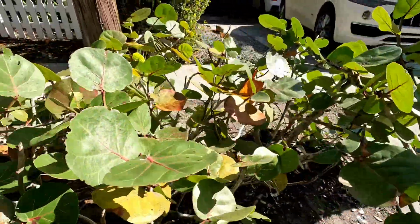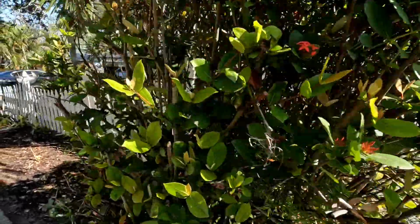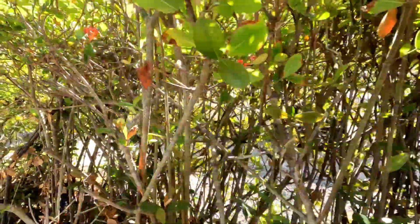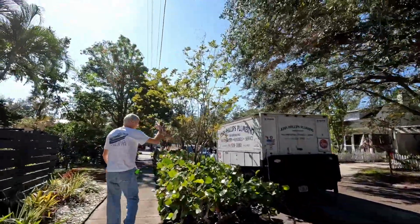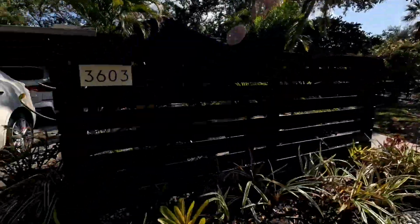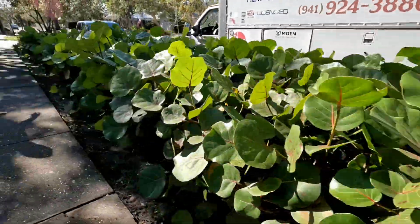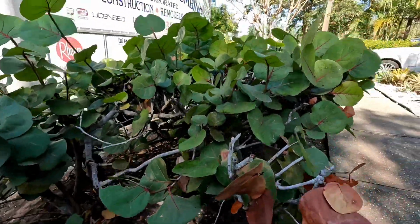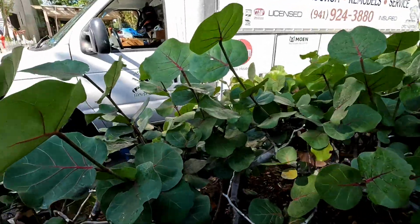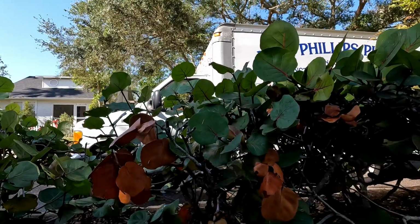So I'm just looking for a backflow preventer or something that's not functioning properly, which would cause you to have low pressure. But I don't see one here. It could be. Yeah, and they're out in that curb, so. Right, but I've not seen one for his, but again, it could be tucked away. Right, so this might be his meter right here. There's his meter. So we just want to make sure that that's open all the way.